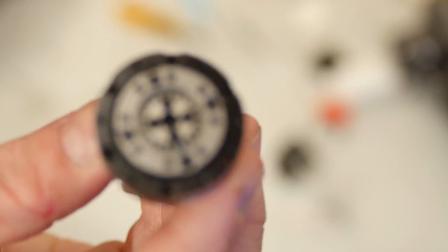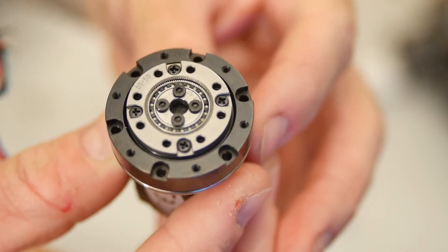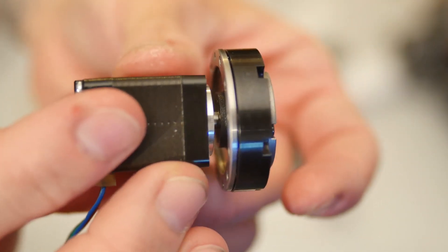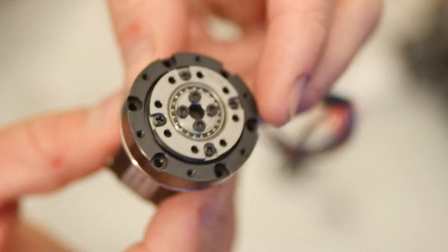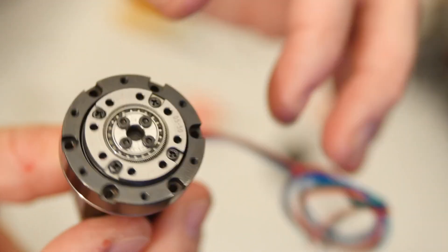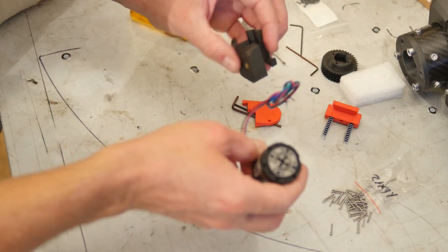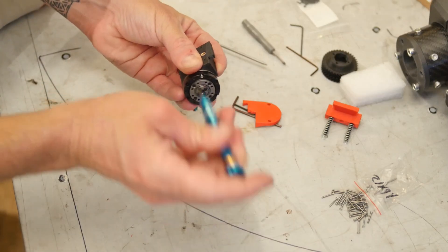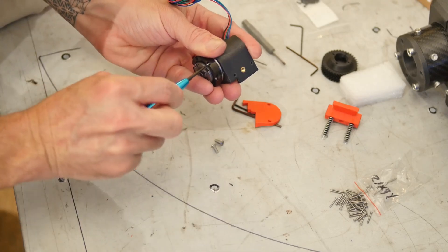Fast forward to the next day — I've redesigned the shaft coupler part and drilled out the threads in the input shaft side of the harmonic reducer so you can just put screws in through the front. I also have a slightly updated housing design, and I've reprinted both parts in carbon fiber polycarbonate because it's just more better for this type of application.